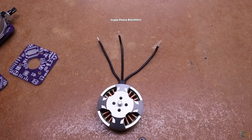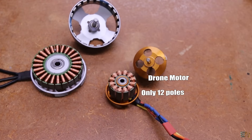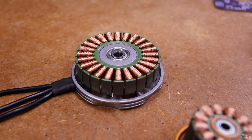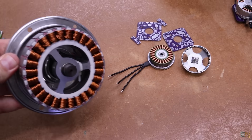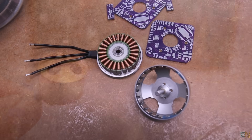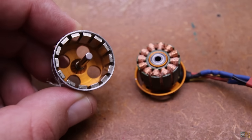These are brushless triple-phase motors and we need them to have as many stator coils as possible. A drone motor has few stator coils so it spins very fast, but position control at low speeds would be awful. For slow, smooth movement in FOC, we need more stator coils so the sine signal passes smoothly — like the hoverboard motor from a previous video. Brushless motors are typically labeled something like 12N14P, meaning 12 stator electromagnets and 14 permanent magnets.